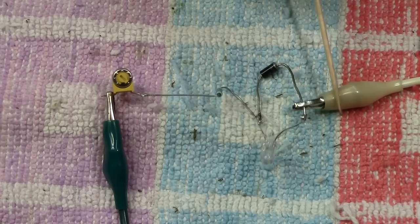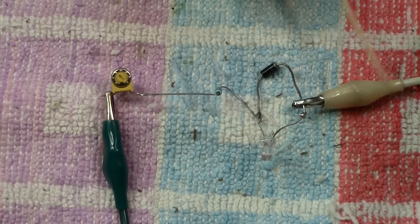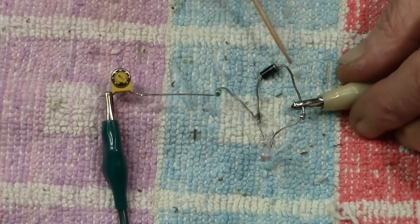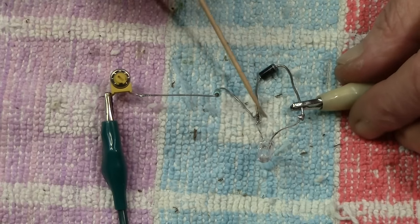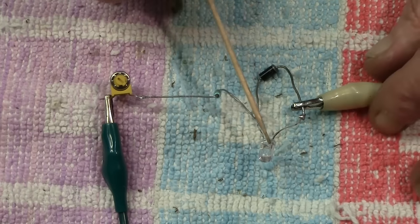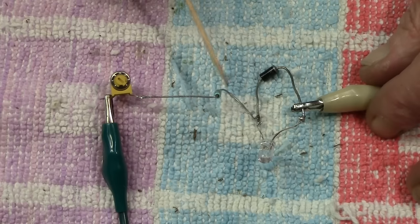We've got one side of the controller here, as we've had all the way through the video. We've got a single LED there, and we've got the reverse bias diode across it, just there, and we've got the resistor here, which, like I've said, the LED always has to have that resistor. Very critical that you don't omit that.